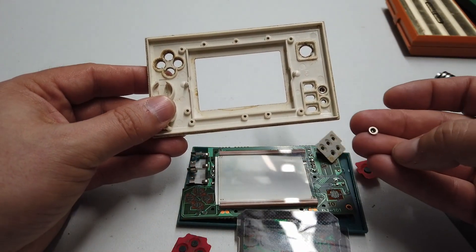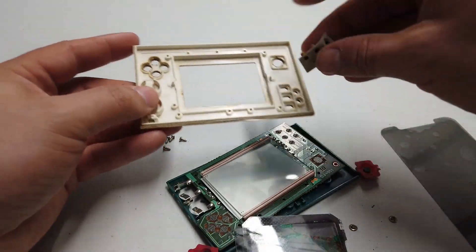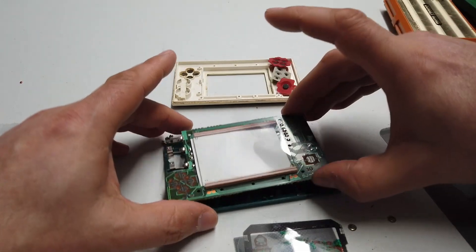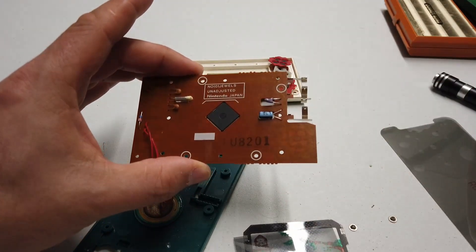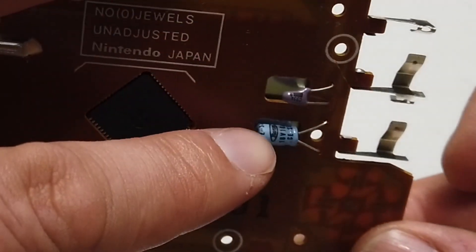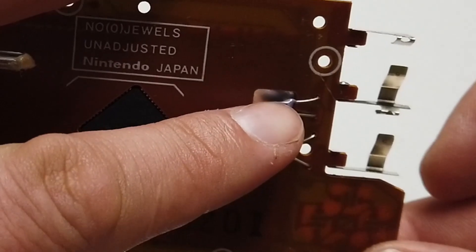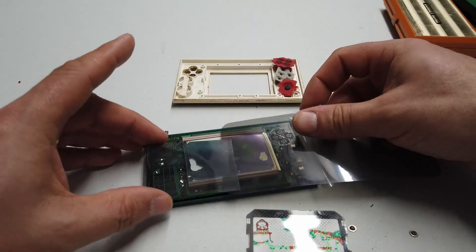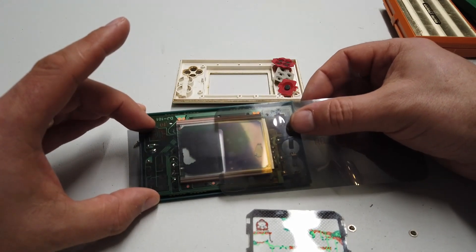Let's get this kit cleaned up — there are little push buttons here, let's be careful with those. Let's get everything gently washed. Then what we'll do is replace these two capacitors on the PCB. One of those capacitors is a 16V 10 microfarad electrolytic and the other one is a 0.33 tantalum bead style capacitor. I can now do a bit of a comparison with a replacement polarizing sheet that I purchased.